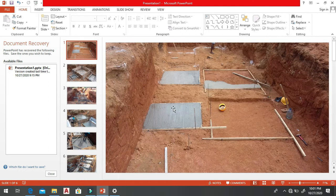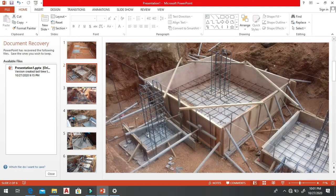If you put the center lines on this screed concrete, you can do the formwork on it. This is the reinforcement arrangement — have a look and get an idea of what we have done here. It is good to use GI pipe for support because there can be buckling. We used two-by-two timber here, but if you can put two GI pipes and the other vertical bars, that is better to prevent buckling due to the load.